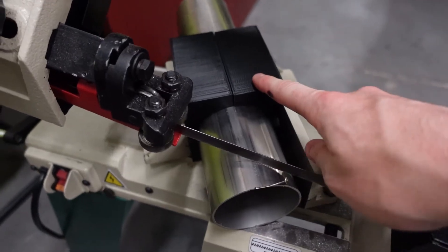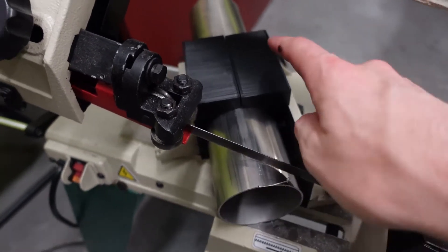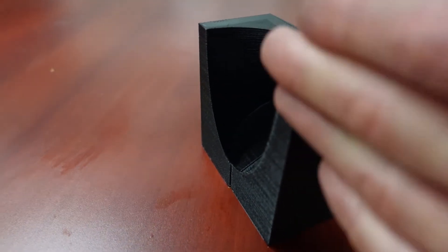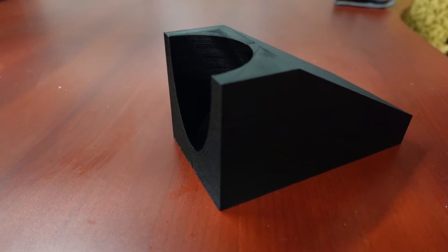Last year I picked up 3D printing, and I 3D print a lot of jigs that help me make really precise cuts. Learning to 3D print is going to be really, really useful — it's going to save you a lot of money and time. Professional machinists use metal jigs that cost hundreds of dollars, so I've made my own jigs using Fusion 360. I have a jig that helps me make the beginning of the 2-to-1 collector — you slide a piece of tube in and it's going to help cut it at a 30-degree angle, then flip it to cut again, allowing two tubes to come together to make the beginning of that Y-pipe collector. Getting into 3D printing and custom fabrication, they all go together.